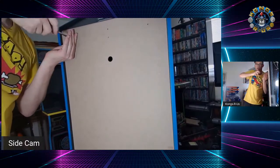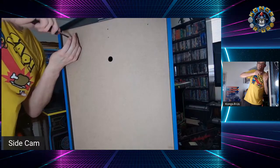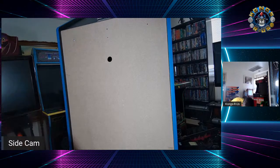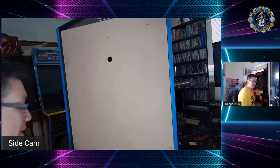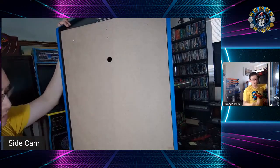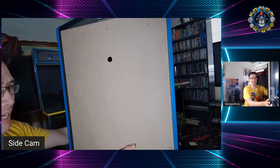You guys ready? I saw how you can get an adapter for SATA to make an additional power input for a GPU card. You can do that, yeah. If you're just using a SATA power cable, you can use that as a 6-pin. The only thing is that it won't draw the same amount of power as a dedicated power supply, so you may not get the full power of your GPU by doing that, because the actual PSU is still limited. These I think are about 240 watts.